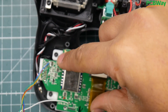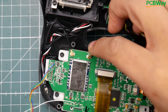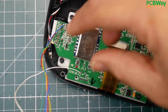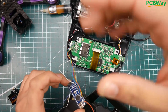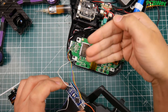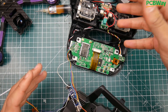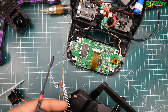I found pinouts for channels one, two, three, and four, which are what we need for the gimbals. These channels get piped into the Arduino on analog pins A0 through A3 — that's four channels starting at zero. The Arduino takes the potentiometer input from the gimbals and converts it to PPM output, which is what the modules actually read.